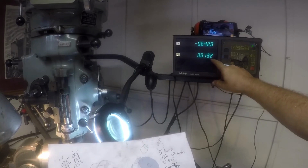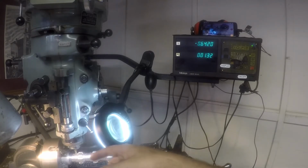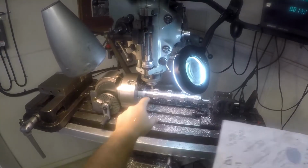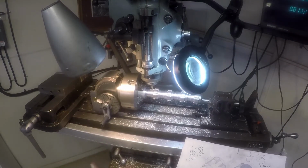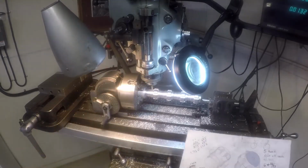Up here, so we actually will move the head over slightly more than a half an inch, somewhere between 550 thousandths, 525 thousandths, and then we'll actually do the same process again, going through and cutting back and forth on each one. This is going to be a significantly smaller cut, and there's a little bit of wiggle room trying to figure out the actual depth that we cut.